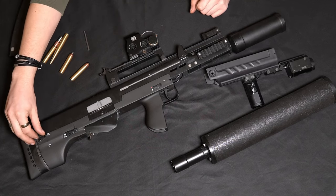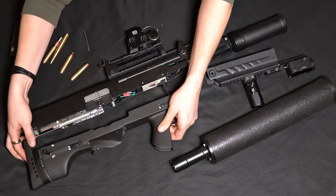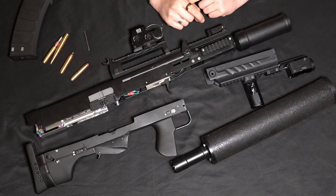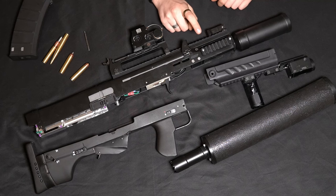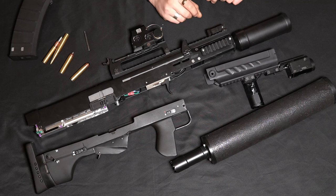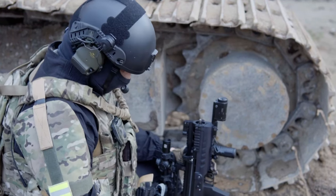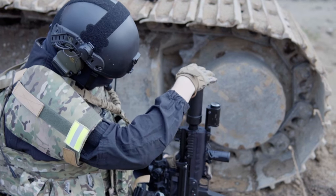All the extra space for big batteries is a nice feature of course. You just flip this little lever right here downwards and the whole gun comes apart. The next thing I made was the muzzle device locking mechanism slash barrel assembly - they retract the pin that secures the barrel attachment. This was the other very complicated part about this build because I wanted it to work exactly like the original. It's a combined piece which allows the small suppressor and the flash hider to be mounted with the quick lock mechanism, while the long suppressor is screwed on and then secured with the same pin.